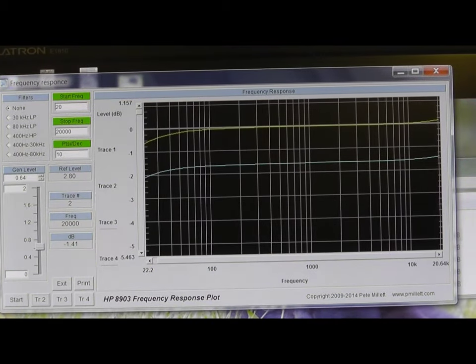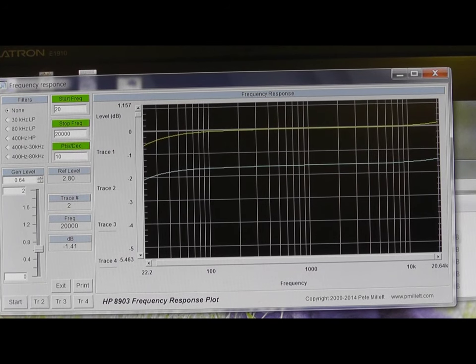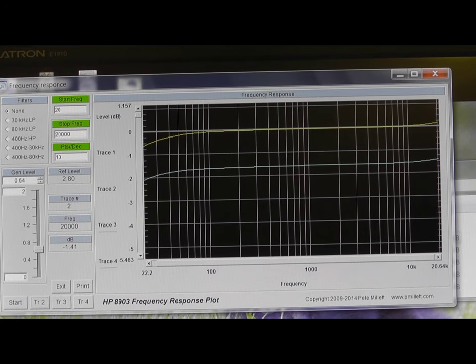Okay, I've just finished the frequency response of this amplifier. It's quite amazing actually. I really wasn't expecting a frequency response as flat as this. As you can see, even down to 20 Hz, it's only dropping 2 dB. That's incredible. You've got to bear in mind that it's trying to pass a 20 Hz signal through a transformer, and the top end rises insignificantly, less than half a dB. Quarter of a dB, it's more or less ruler flat.